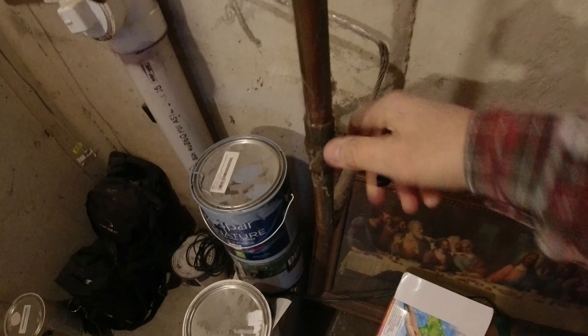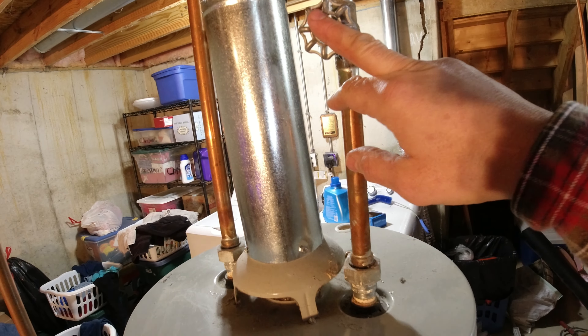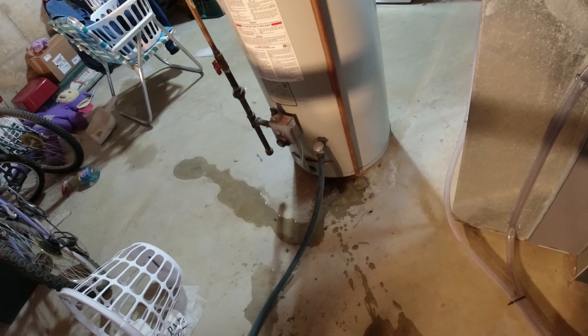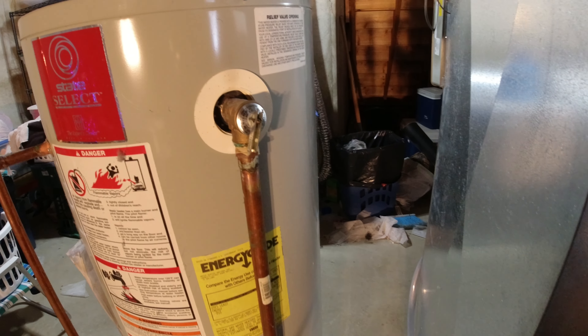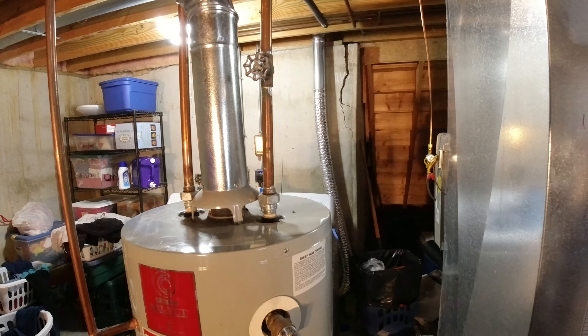The other thing you're gonna have to do is turn off your main water as well, because your system is gonna push water back in through the main system. With the main water off and your valve closed, get your little garden hose, screw it on to the bottom faucet on your tank, and then run it over to a drain or into a bucket. We just need to get the level down enough so that when we hit the valve no water comes out. Make sure your water is turned off to the hot water tank.